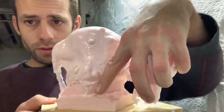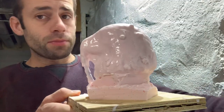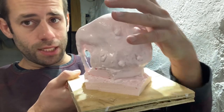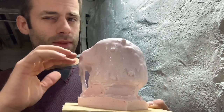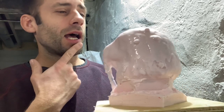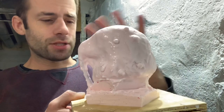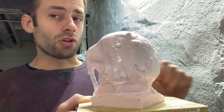It got a little thick on the bottom there. I trimmed off all this waste — I probably should have had the thickener thicker than I had it. What I think I'm gonna do is lay it down in clay, cover one side, and pour the plaster over. I could smear plaster on the mold but I feel like that's gonna lead to more troubleshooting, whereas if I just lay it down and pour the plaster over it, it's gonna be easier in the long run.